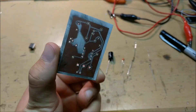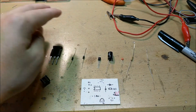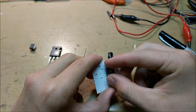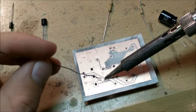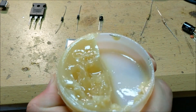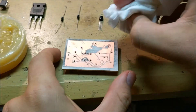After you have your circuit board all completed, what I did — though you don't have to — is write where all the components would go, to make it easier when placing them since I didn't have a silkscreen. These are all the components; I got them from LCSC. Because the circuit board is already prefabricated on the bottom, it's going to make it very easy to insert all the components — all you have to do is push them through the holes and solder the bottom. It's also helpful to use some flux on your circuit board when inserting components and soldering, because it's never been soldered or tinned before. Just take a tissue, get some flux on it, and wipe it on the board.